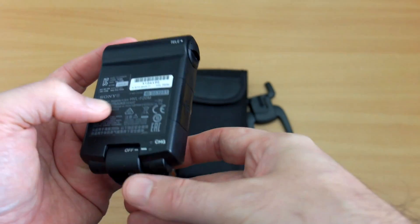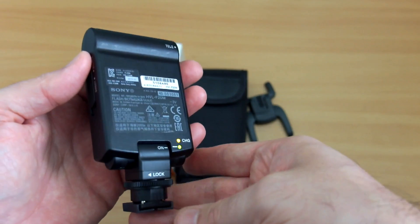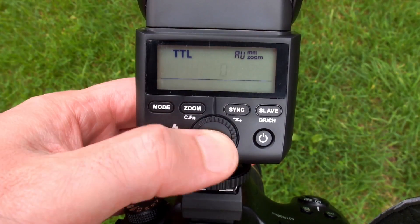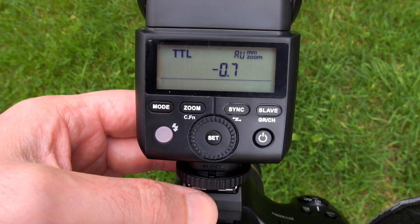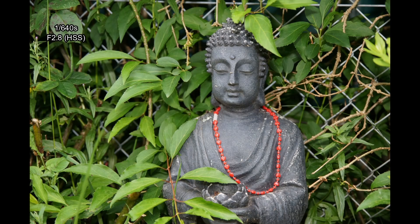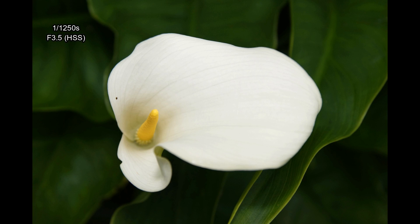Comparing this to the F20M, the main annoyance with the Sony flash is it costs more than the Godox and you can't rotate it. It seems designed for the A900 just to provide a cheaper optical master flash for a camera without a built-in flash. You can press the set button and use the jog dial to set exposure compensation - remember this is cumulative with the camera setting, so if you set the camera to minus three and the flash to plus three they'll cancel out. The high speed sync has limited range because of the power, but it can be useful for portrait shots of one to three people.